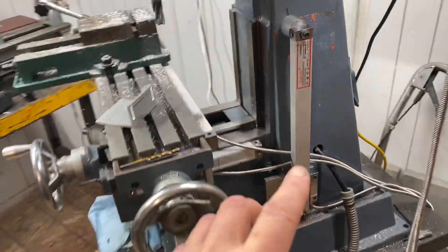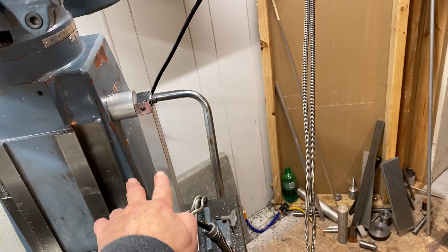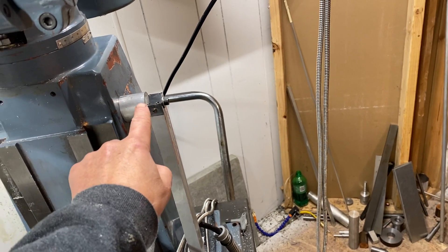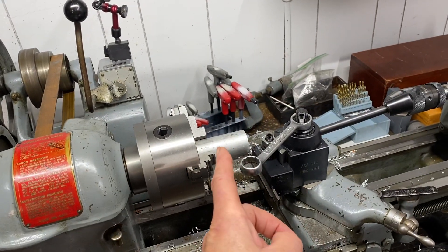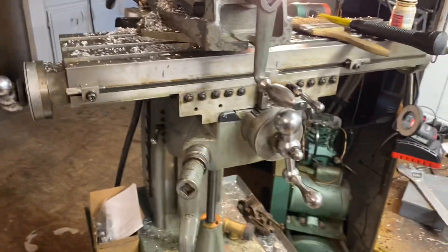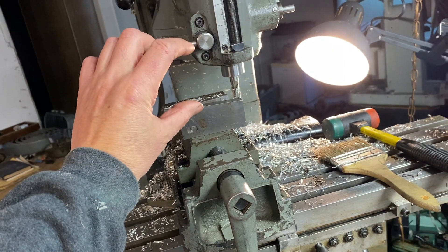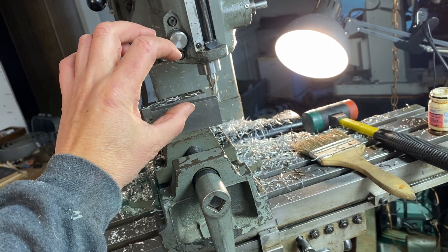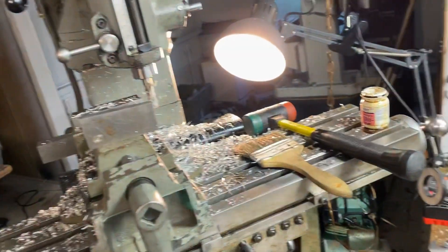How I did this: I made the lower one right and got it bolted on there, then stuck a wedge in here to hold it in place so I could get a measurement all the way up and down where it was basically running parallel. Then I took a measurement for the widest point I was going to need up here, came over to the lathe, used my parting tool, and made myself a piece at the widest point. Took it over to the milling machine, I've got a three-degree angle plate - stuck my piece in there at the three-degree angle and just nipped it off, leaving it at the longest point I had measured.